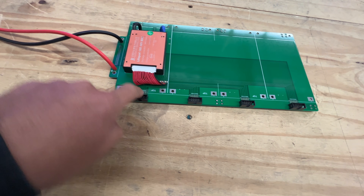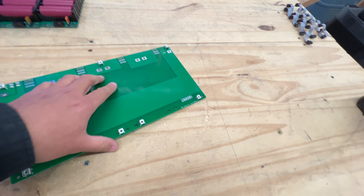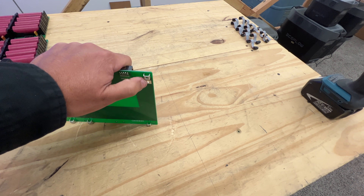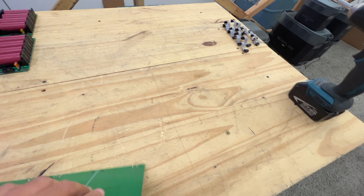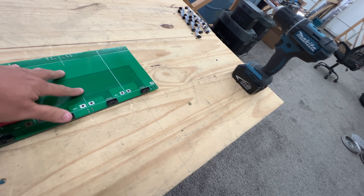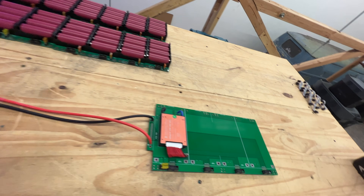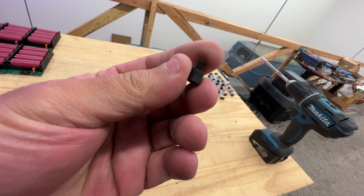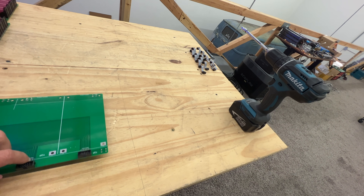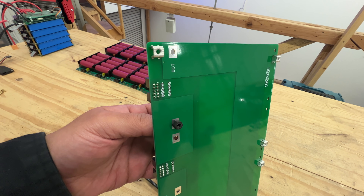It's fusing it, and it's fusing all of these ones in here — so it's redundantly fused. It's got legs so that you can mount this inside a box if you want. These are metal feet with M4 threads on the bottom, but they are isolated — they're not connected to anything on the top. So it's safe to put this down even on metallic surfaces. The old way of using little plastic feet was causing too much trouble because those break easily, and these batteries weigh quite a bit.